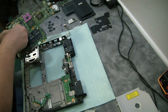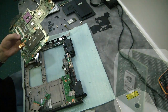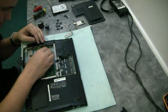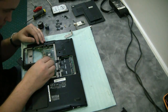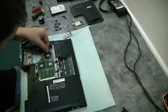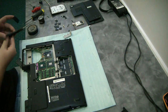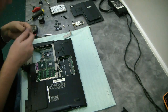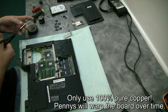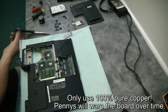We have pretty good success with this — nine times out of ten the reflow does it. Sometimes we do have to pull the chip off the board, take all the solder balls off, and actually re-ball it. Now he's putting thermal paste on — more is not necessarily better, just a nice thin coat. While we're talking about copper, do not use pennies. I don't care how many videos you've watched with people putting pennies in them — it does not work. As Trey just said, it's not a hundred percent copper. What we use here is a hundred percent copper.